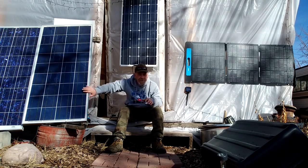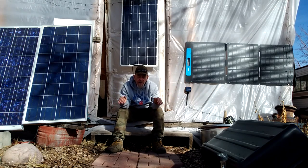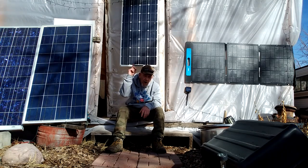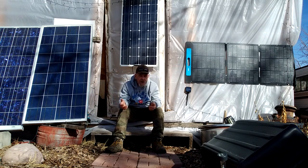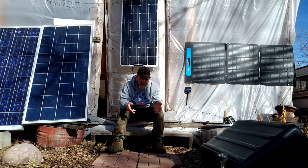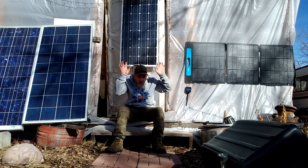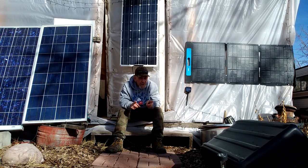I'm going to be replacing all of these with a 200 watt set — two 100 watt panels with special mounting brackets that make them adjustable — and I'm going to be putting them up on my porch roof. I used to have old panels up there, but we'd get so much snow I had to scurry out my window and brush them off, which was unsafe and a lot of work. These new adjustable panels can be set almost perpendicular so the snow just slides right off.